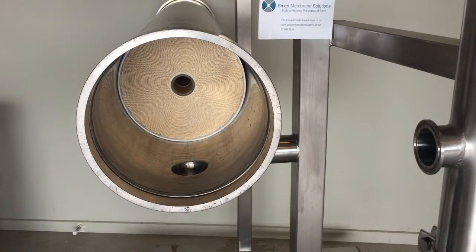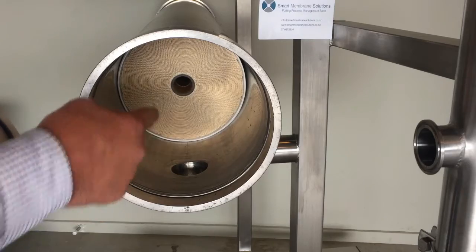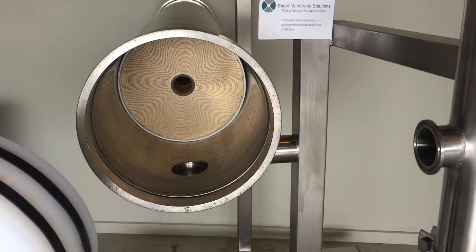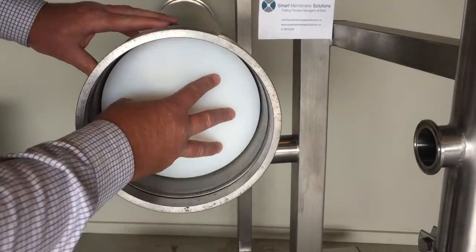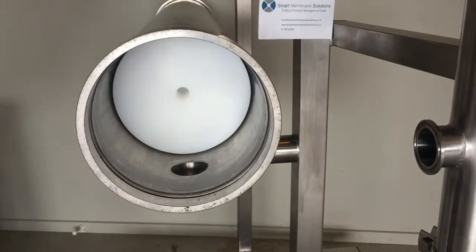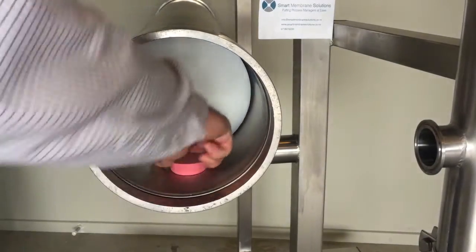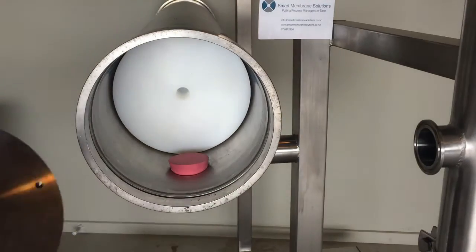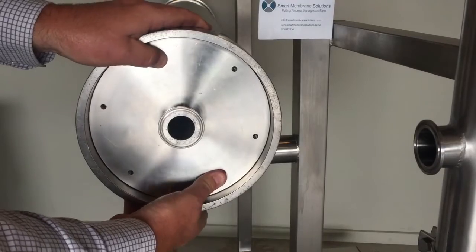Okay, let's demonstrate how to pig out a stuck membrane. First of all you've got to make sure the membrane has gone past the outlet port, to the width of the pig. You put the pig in with the lip seals facing this way. We always recommend to do this from the permeate outlet end of the vessel. Stick the pig in, make sure it pushes past the outlet port. Put the bung in to seal and stop liquid bypassing. Then grab the permeate outlet port and stick that in.